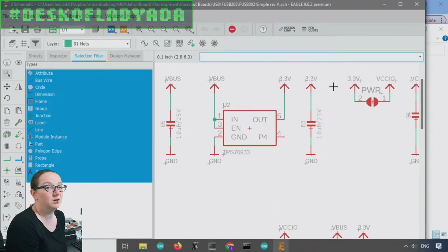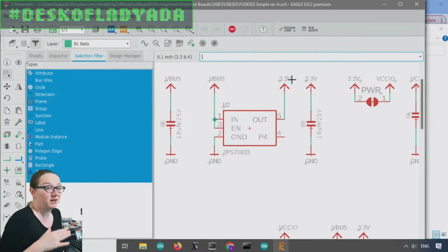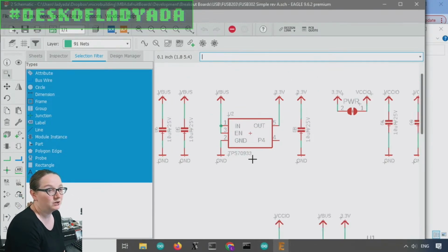This needs to work no matter what. I don't need a lot of current, maybe only 10, 20 milliamps. But I do want it to function and not blow up, even if it goes up to 20 volts. And I want a little bit of headroom above that too, right? Because you can sometimes get 21 volts out of the USB PD, and then maybe there's a little bit of spikiness. So let's say 24 volts, right? Just to give ourselves a 20% engineering margin.